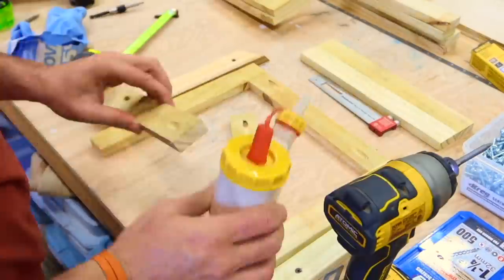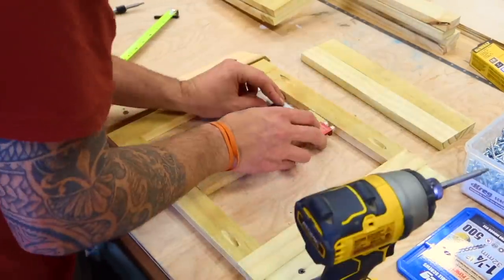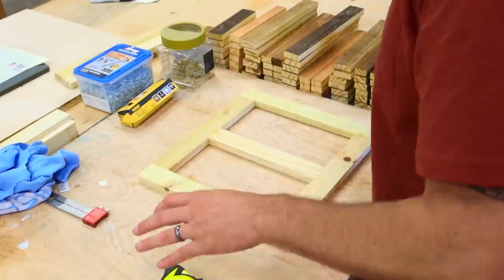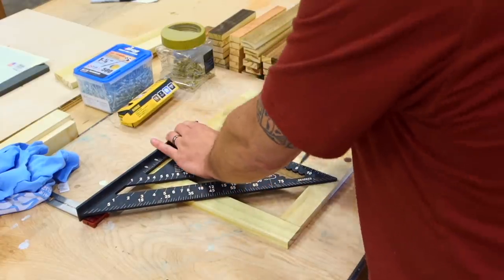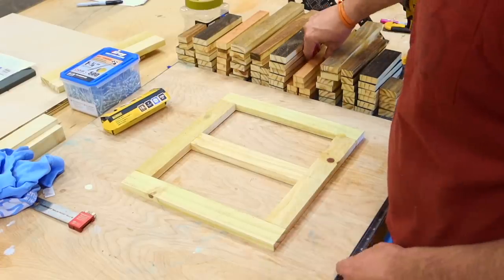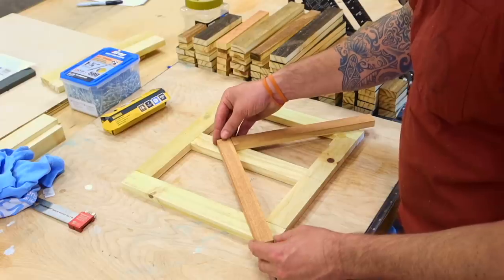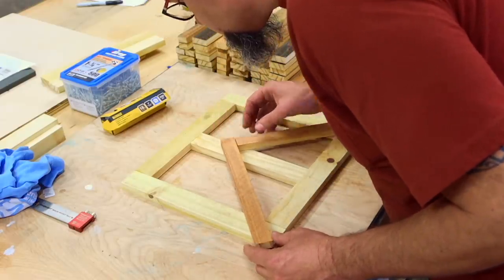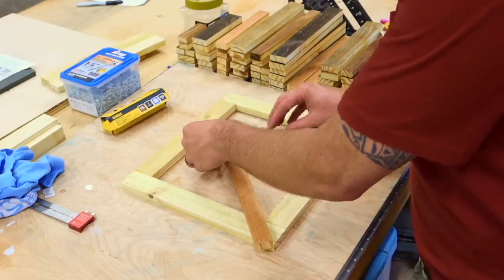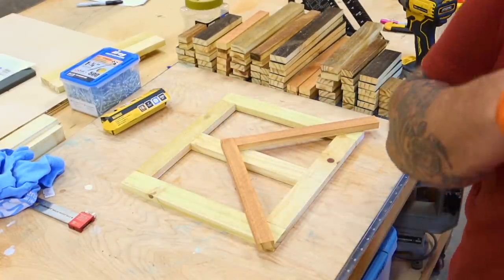I've had some questions about my glue bottle — that is actually called a glue bot. I'll throw a link in the description. Probably one of my best purchases lately because I don't have to wait for the glue to get to the end — it's just always ready. So once all of your frames are built, we're going to start assembling the panel. I'm just marking the center of my center board, three quarters of an inch in. I have all my parts laid out in order from the cut list — this is A through K — but I'm actually going to start with part G. The reason is because I can line it up with the outside edges of the frame and it will still meet up square in the center. The left side, I want the top corner to meet up with my center line, and for the right part, I want the bottom corner to meet up with my center line. The outside edges will meet up with the top edges of my frame.